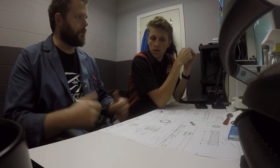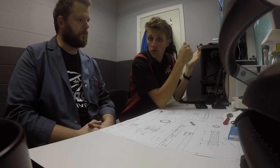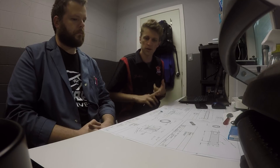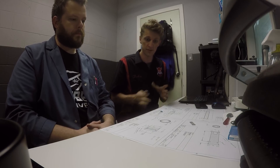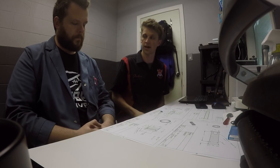There might be some design changes, but it's just tolerances. When we made the first batch of 35-ish, we had to scrap a bunch of parts because they just weren't fitting together. It's a little bit of tool wear, a little bit of thermal growth — some of these tolerances have to be silly tight and tighter than we expected. Because the stack is probably like two or three things put together that if they're not within spec, the tolerance stack just makes it grow.